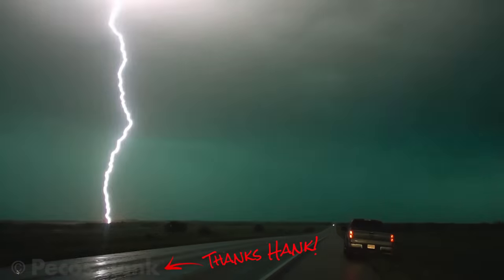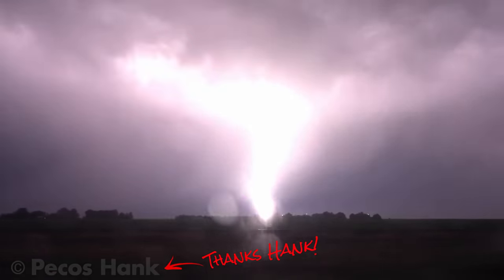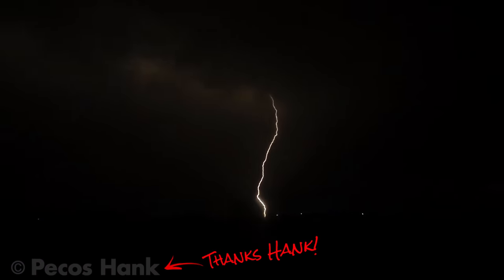The light that they emit has a really nice decay to it, so they give a very natural fade after the flash, which you wouldn't get with modern flashes, which are strobe-based. They're designed to give a very, very fast flash. These actually give a pulse of light, and after they flash, they decay down, which is very much like you'd see in nature when lightning was brewing in some clouds.